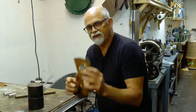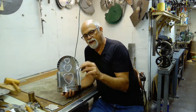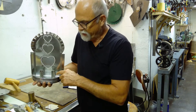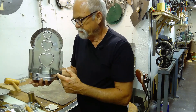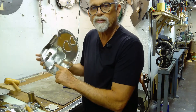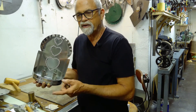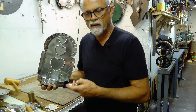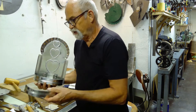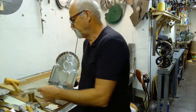This is basically the configuration of the bottom. I held the candlestick holders in place and soldered them onto the bottom prior to putting the front grill on — only because it gives you a little more accessibility to solder. When you solder these candlestick holders in place, you really need to get full penetration all the way around, because candles aren't all standard — especially hand-dipped ones where there could be a variance of an eighth of an inch or so. Putting the grill on was as simple as holding it in place and soldering around the edge.